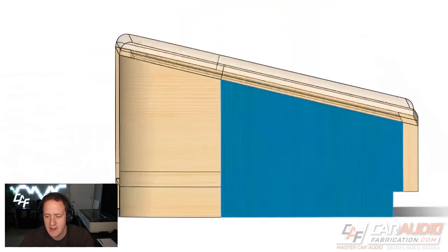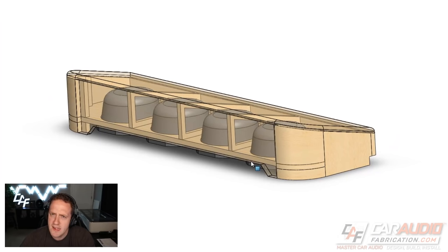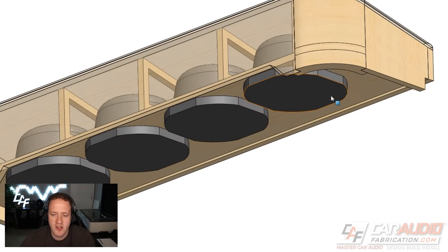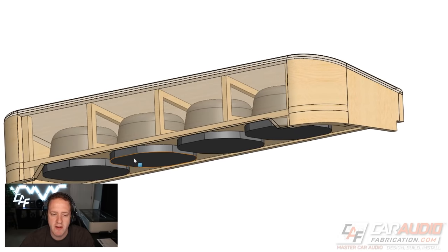On the back side, there's a small notch that gives a little more clearance so the box can extend further under the seat and gain a little extra air volume. The subwoofers are down-firing, which loads the wave off of the floor — a nice solid surface — rather than having them up-firing. Sometimes up-firing makes sense, but for this application down-firing is the way to go.